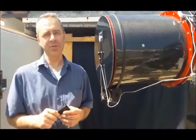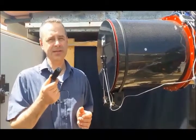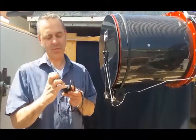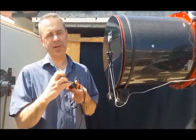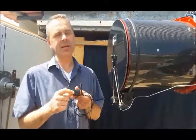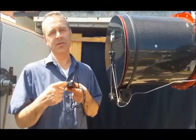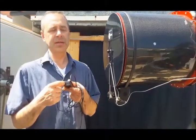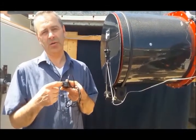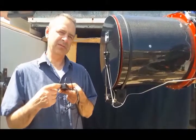The most economic option to control your SNAPCAP is this small black box. It has a relay inside that can invert the polarity of the motor. It has two inputs: one needs to be supplied with 12V direct current whenever you want to use your SNAPCAP, and the other input is the trigger for opening and closing. When this input is under 12V power, the cap will open; when power is removed via your computer-controlled switch, the cap will close.